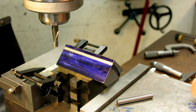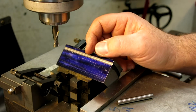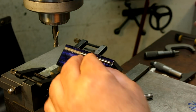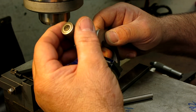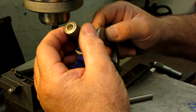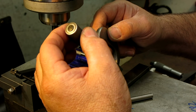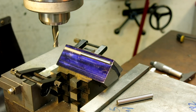So after that discovery, what I want to do is take some measurements with, if I don't drop it, a smaller pin that definitely is engaging the groove in a tangent way, which is what we want. So we're going to take a new set of dimensions. Make sure I got it on there right. 31. Okay.